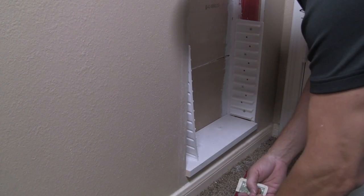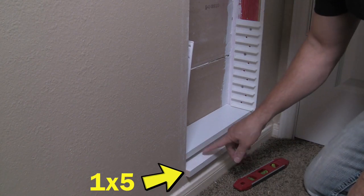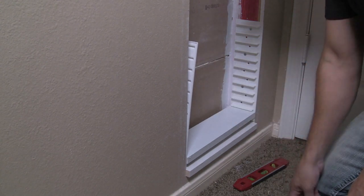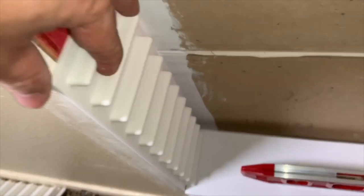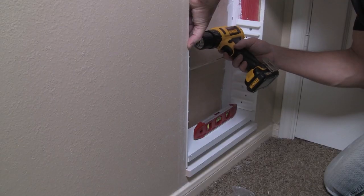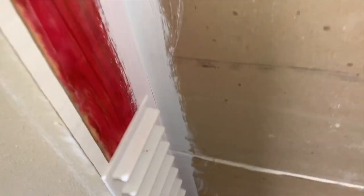Put the money back and go cut the board. We got the shelf cut. This shelf is a one-by-four. The shelf underneath it is a one-by-five. Home Depot sells one-by-fives — it's the only place I've been able to find it as of today. Since we took the sheetrock out and moved this to the front, we have a gap back here. Little stuff might roll off, but I like the one-by-fives. My thumb is resting up against here making sure it's nice and flush. I've got the shelf — see how it's not level. I just start lifting up on it until it's level. Once it's level, I'll come in and put the screw in. Nice and clean, level. Now we'll just continue on up.